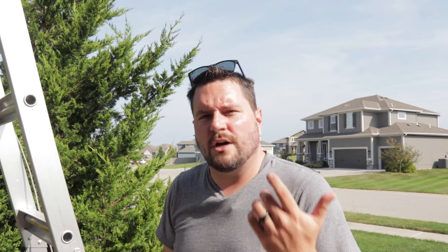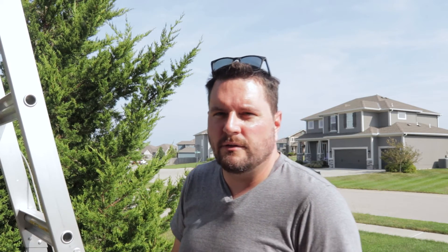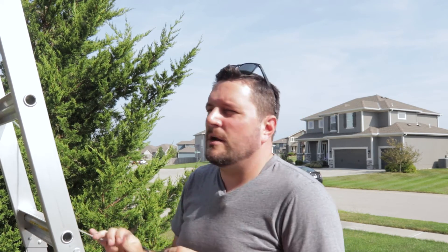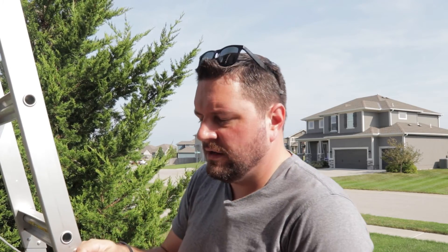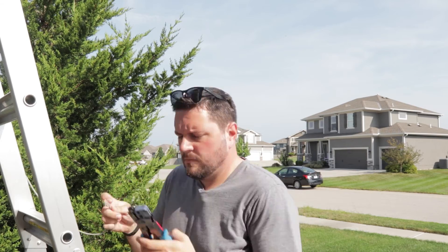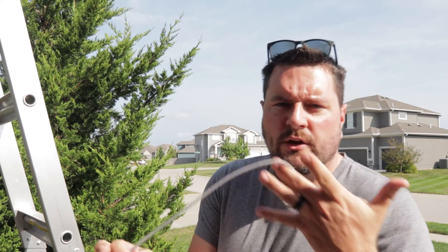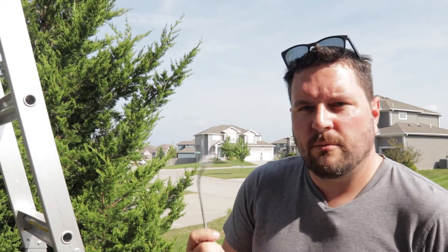If you can avoid it, try to make sure you have a long service loop on your cabling, because you don't want to be climbing up that ladder every time you need to re-terminate the end of the cable. You can always tuck the service loop along your downspout if needed. I'm going to quickly terminate this cable with an RJ45 end and then plug it into the camera. It's funny — every time I want to record a video outside, everybody starts mowing their lawn. I'll also go ahead and terminate the inside cable, again leaving a couple of feet of service loop. Now both ends of the cable are terminated — let's plug it into the power over ethernet adapter and make sure everything looks good.